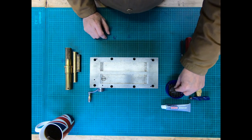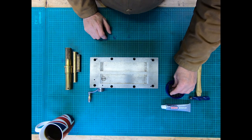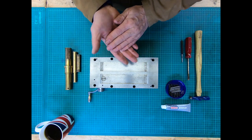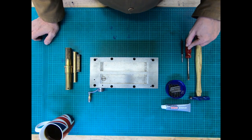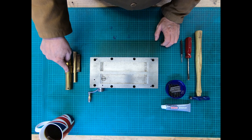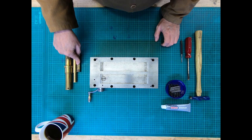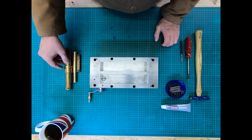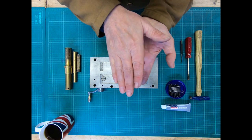As well as the bolts, there are five locating pins. All the tools I needed to take it apart were a small hammer, screwdriver, and a punch. I also have some non-magnetic drifts - just some brass rod - which I used to prise the two sides apart.